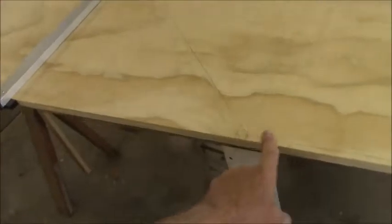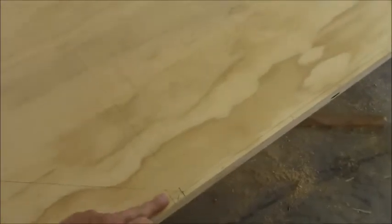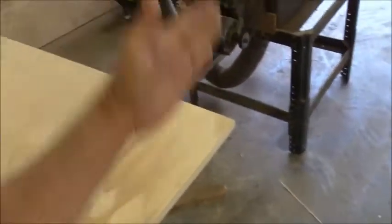So I am going to do that. I've come up with 45 by 45 as the overall dimension. The confusing part is where everything overlaps in the front. This is where the face frame comes across for the doors, and this is where the vertical end goes in. We have to cut 3/8 of an inch off because it's going to be dadoed in, so it needs to be 45 overall.